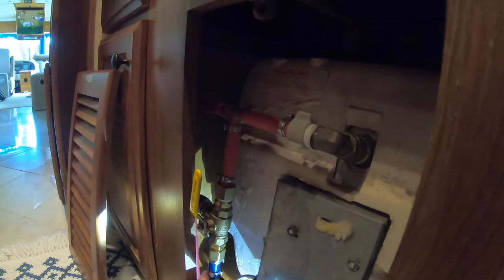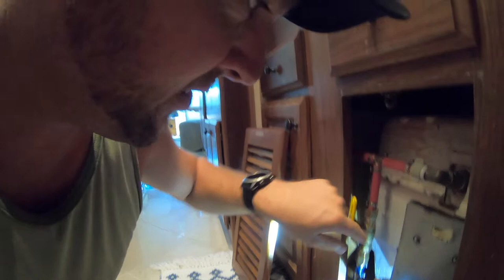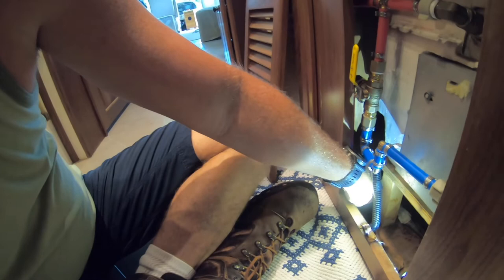My hands are currently dry. I'm going to feel around each of the joints for any water. You want to feel every spot you've been at. Feel for any drops of water. And as you saw in my case, this valve, the body, the three outlets here were my primary problem. And this thing is nice and dry, which is awesome. Oh, that's so awesome. All right, and then the last two down here I've got to check out. Let's see, no water there, no water there.